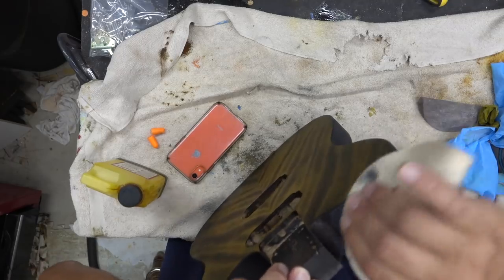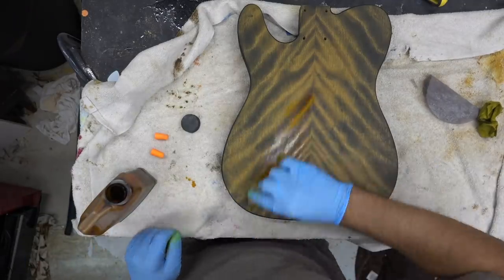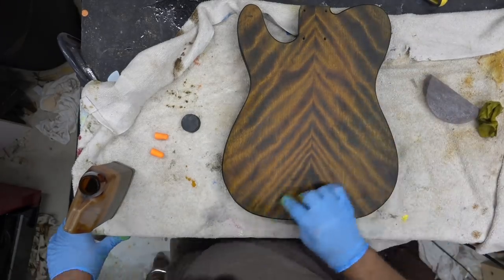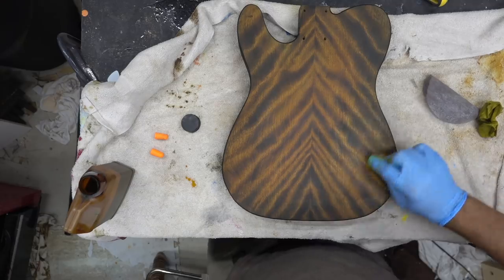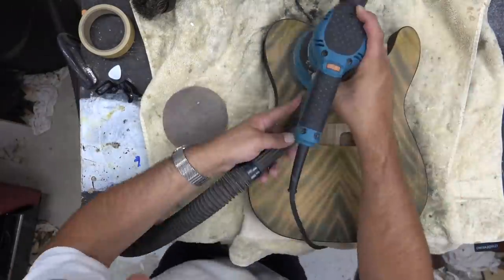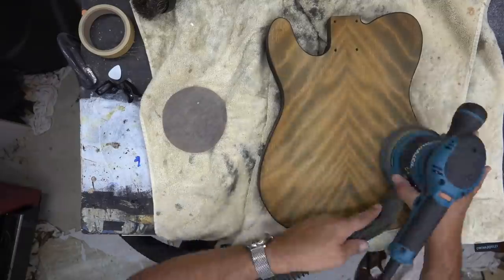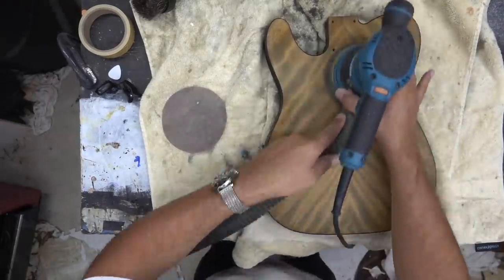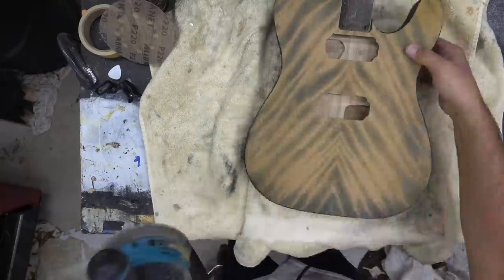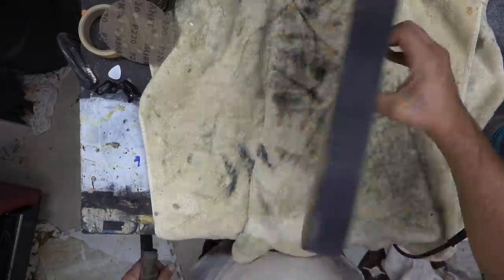We went to the internet - on my YouTube page and Instagram I posted asking what color we should do. The consensus came back to try orange, which I tried and it actually looks a lot better; the orange and black hues really get picked up. The other consensus was to go a little bit darker. So that means we have to sand off again. This time we went with a more aggressive 220 grit and then went back with 320. The trick was to get the color even again, then come back and hit it with black once more.